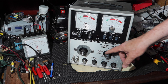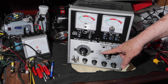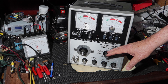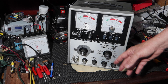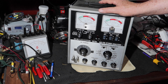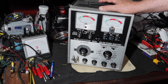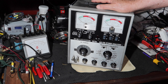What I'm primarily interested in this for is just doing the FM sweep around 10.7, throwing the markers on it so I can check FM IF can tuning and the discriminators. I want to make sure that the 10.7 is still kind of where it needs to be. While I've got it open, I'll check a few things I can check. I have the manual on this, and I'll just check through what I can. I haven't ever done the caps in the power supply on this — I'm sure it needs to be done by now. I thought we'd just open it up and see how it looks.